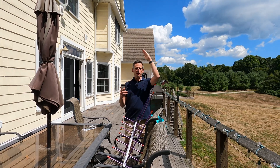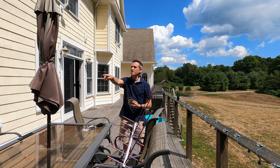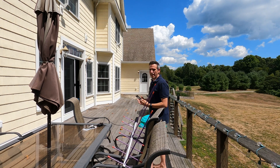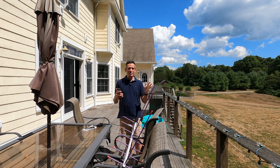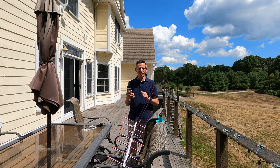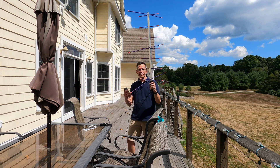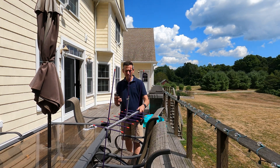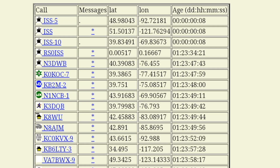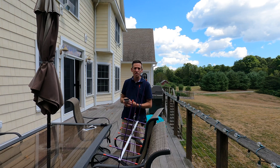We are now about 10 minutes away from the ISS coming above the horizon. On my app I can see it just below the horizon now, coming up this way. The ISS is going to come up this way, go right overhead, and then continue its orbit in that direction. I have my other radio tuned to the same frequency so I can hear my signal go out and also hear when things are overhead. I need to keep this antenna pointed in the right direction — I think I'll mostly just have to point it straight up for the best results. On my other phone I'm monitoring the APRS.fi website, which gives a real-time view of what signals are being sent back from the station to listening stations on the ground.